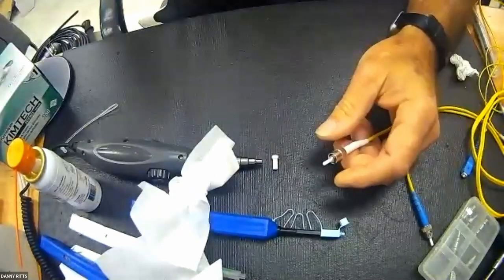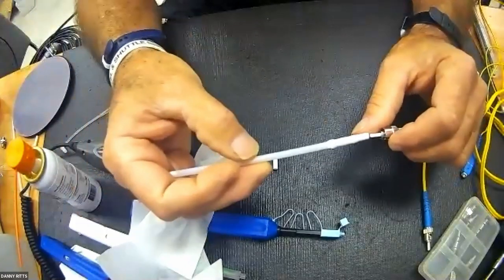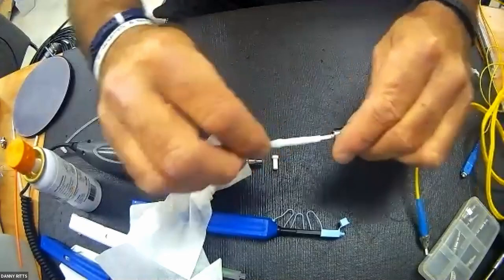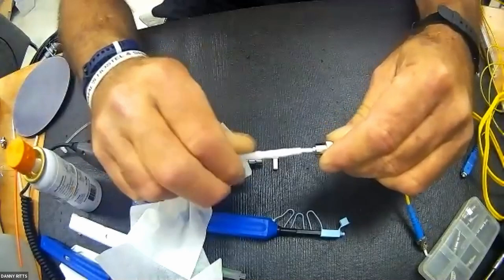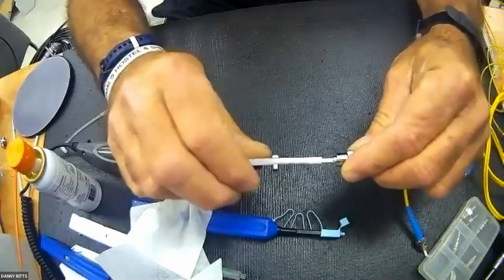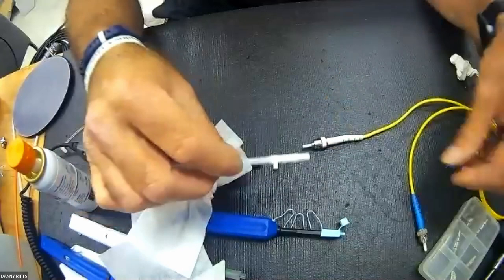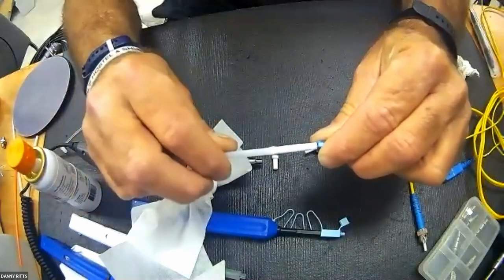Sticklers also makes a reverse Q-tip concept. It is a fibrous material that is inside of a tube. This is for any exposed 2.5 millimeter ferrule. It'll even do a 1.25 ferrule. Basically, you can rub the surface of a contact, preferably in a wet-dry combination, to scrub the end of the contacts. This plays an important role if you need to reach inside connectors, which I'm going to demonstrate in a moment. But this particular one would also work on a 1.25 ferrule to rub it down.